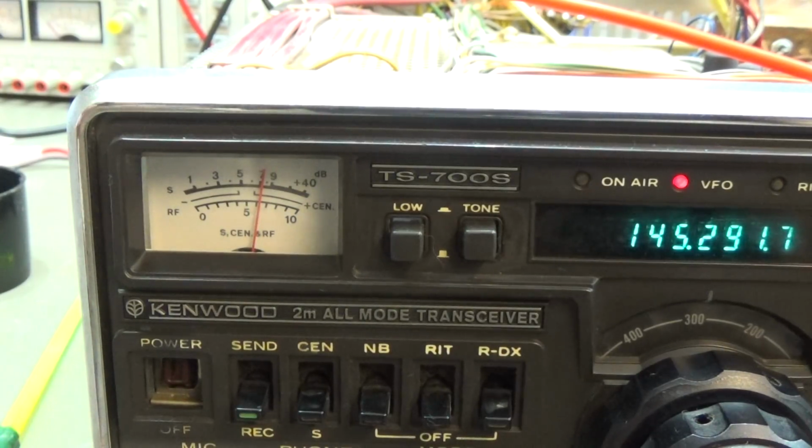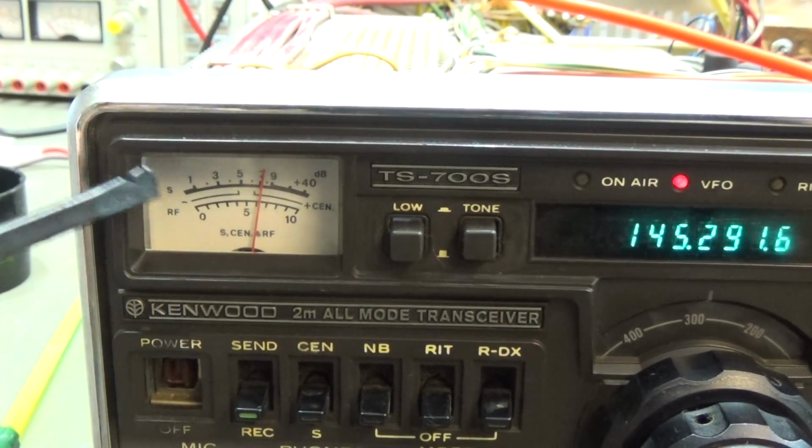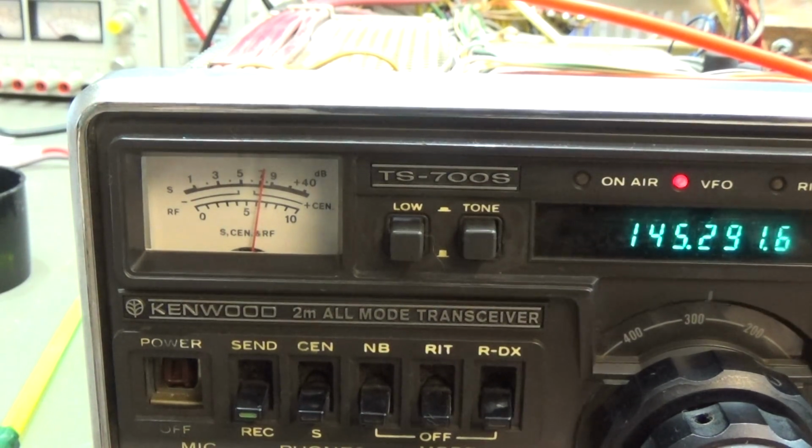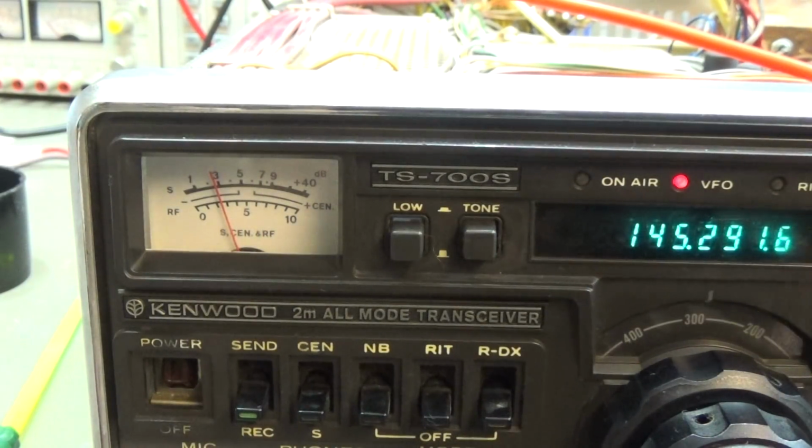Oh, and we have seen all the reaction when we switch on here our modulation. Now everything seems to be fine. Of course we are on FM, and when I now switch our modulation back in, you see our S-meter dropping, and that is of course telling me that there is a bit more wrong than only our S-meter adjustment.